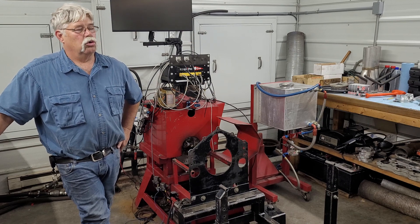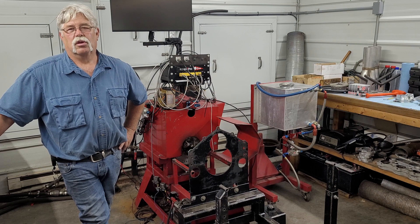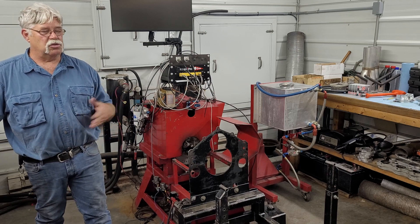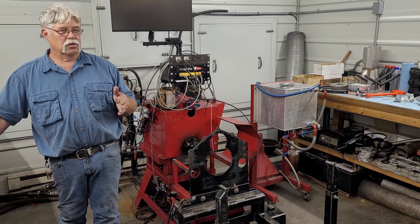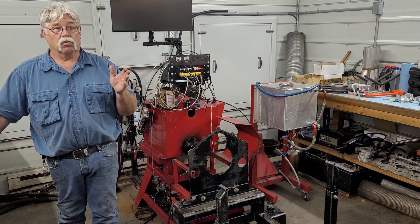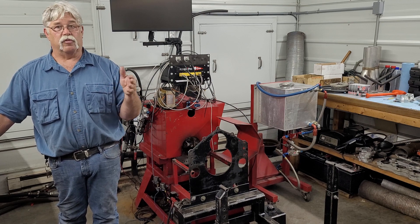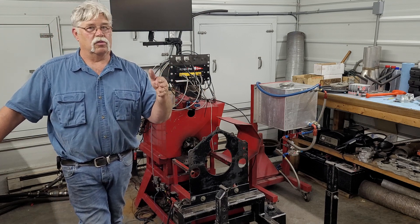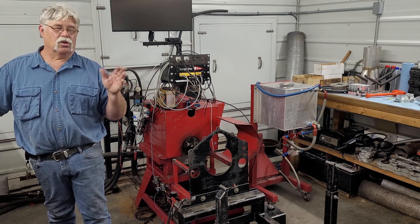The dyno will repeat a 1,000-horsepower motor down to a half a horsepower. When you're building a 1,500-horsepower motor and spend seven thousand dollars on cylinder heads to realistically gain only 25 horsepower, if your dyno isn't repeatable within half a percent, you'll be chasing your tail all day — one pass gives you a 25-horse increase, the next gives five, the next might show a 10-horse loss, so you don't even know if you're tuning it right.